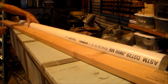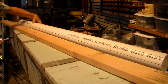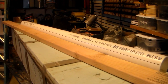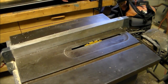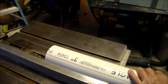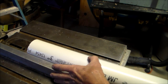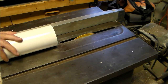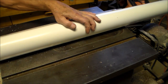You need to draw a reference line on this tube. The easy way to do it is to use a two-by-four as a guide. You'll need to make two of these lines about a half inch apart. Set your table saw blade to be about a quarter inch above the top of the table surface. The reference lines that you drew on the tube will be used as a guide on the top edge of the fence. Stand in a position where you can easily see your reference line along the fence as you're feeding through the saw.